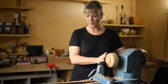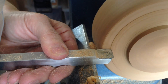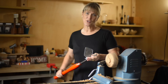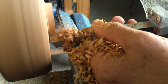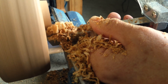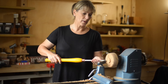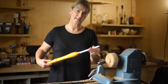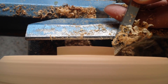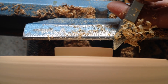I've got the bowl blank to this stage by using the roughing cutter. I went in a couple of centimetres and then I turned the tool rest around on the front and plunged it in that way — and it was terrific. In order to get the angle on the tenon so that it will fit the jaws of my chuck, I used the detail gouge. You just go straight in and that gives it a nice angle so the jaws can clamp onto it.